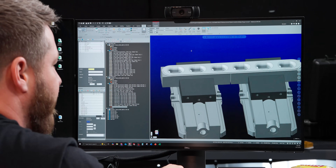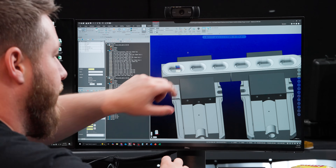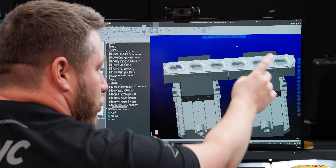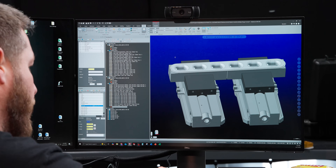The last thing I'm going to make sure of is that I come in with my face mill and deck the entire top of all three jaws to make sure we're sitting flat. From Op 1, we run a finish pass on the two slots on the end — we're going to use the one on the far left side to set our work offset for Op 2, coming in to probe Y and X so this part is located perfectly every time. We'll also run a finish pass on the slot on the far right side in case we want to put an indicator in for a sanity check. And we need to make sure we don't put too much pressure when clamping — these pockets are all the way through with a thin wall, so the last thing we want is to over-tighten and start distorting the part. With that said, let's start making a fixture.